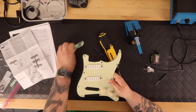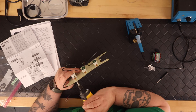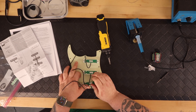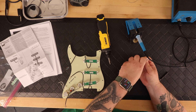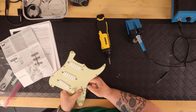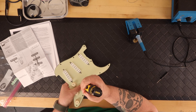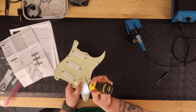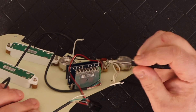Tinning is just heating up solder on the wire tips — don't put a lot on because you don't want to make the tip of the wire too large to fit in the small holes. But it does keep the wires together so you don't have to worry about wires fraying. The switch comes with a little tiny screwdriver and you're going to have to use it; unless you have the screwdriver you use for your eyeglasses, you're not going to have one that small.